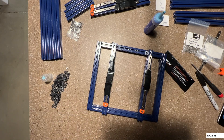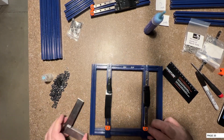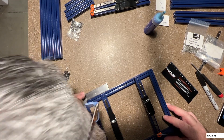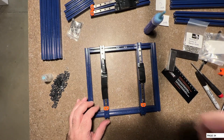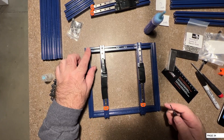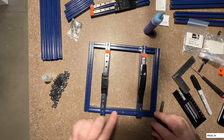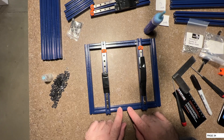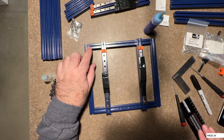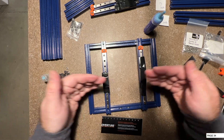Now I'm just going to double check that everything's nice and square on this side. There shouldn't be any gaps. Now that we've got all that done, our goal is to set the distance for these Z extrusions. Right now they're not quite where they need to be. You know it's the bottom because it's open and you've got your two preloaded things at the bottom. These need to be 58 millimeters from the edge of the extrusion - right now they're way off, like less than 40, so I'm going to have to push both of these in quite a bit.